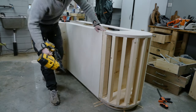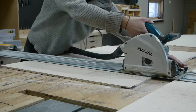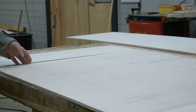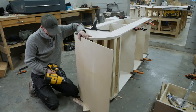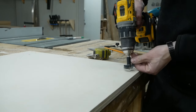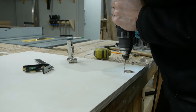I then started covering up the framing using 9 millimeter plywood. Nine millimeter plywood does not naturally bend, so I had to cut some grooves that went almost all the way through, leaving roughly two to three millimeters, with a cut every centimeter. I applied some water to make the plywood softer and worked my way around the curve, making sure to use plenty of brad nails. Next I installed the cabinet door for the front cabinet using a double layer of 12 millimeter plywood and two soft-close cabinet door hinges.